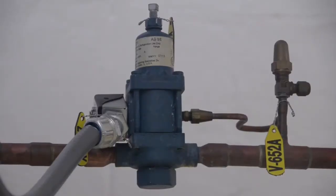Okay, so this is our hot gas bypass valve, and this solenoid on the valve, the solenoid you can see here, is activated by the hot gas bypass switch. When our suction pressure drops, this solenoid will be activated and open up this valve, and this will allow hot gas directly from our compressor discharge to make its way through to our thermal expansion valve. The valve is a self-regulating valve. You can see the small line on the downstream side. So it has a reference pressure on the downstream side.